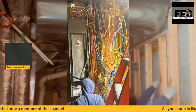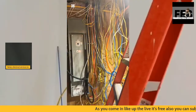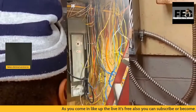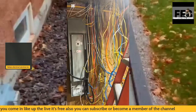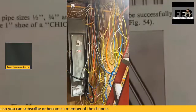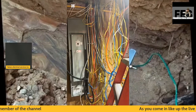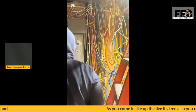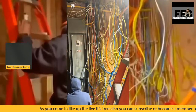It's always best to make sure that you label your cables correctly before you even install your wires. What's going to happen is you're going to end up doing a lot of troubleshooting at the end of the job. So simply label the wires accordingly to where they go.